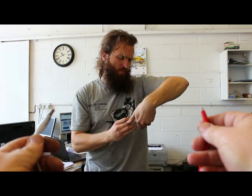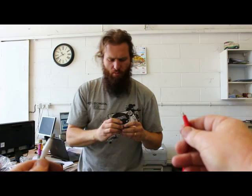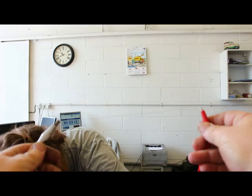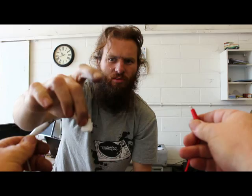Steve wanted to cut some polystyrene, so we had the idea to make a polystyrene cutter. We got a freebie from the Crazy Wire Company along with some nickel wire that Rob had ordered. This is kanthal wire — a resistive wire made of chromium, aluminium, and iron. The aluminium oxide allows it to heat up in air without fouling, so if you stick a current through it — in this case a 12-volt supply — at about 5 ohms per 10 centimetres resistance, you get yourself a nice cutter for polystyrene.